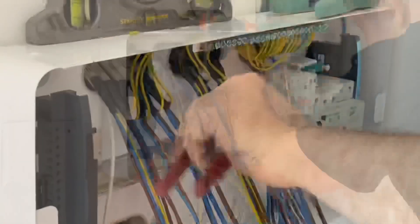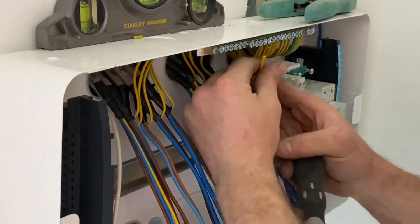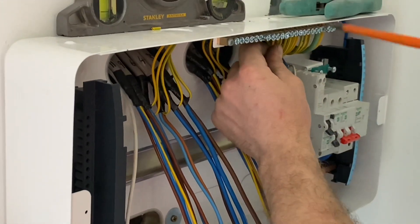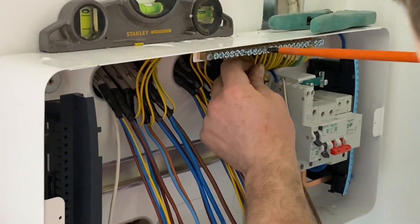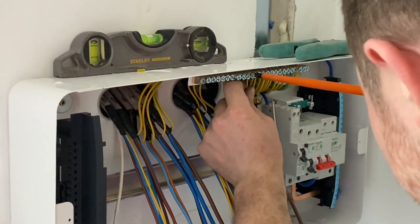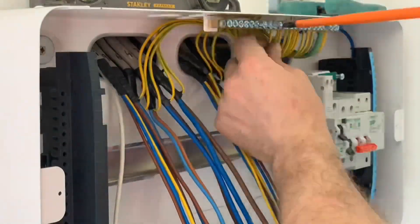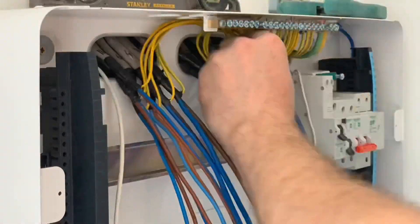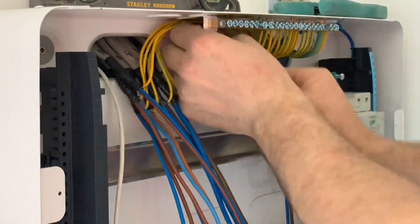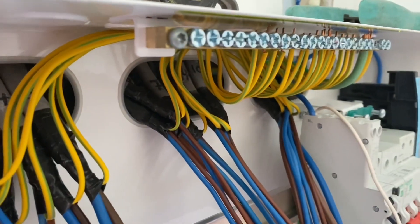There's also the alarm cable that was used to feed what is now a smart doorbell — at some point he'll over-sleeve that as well. Another problem we picked up on our initial inspection of this project. I always like to think when you take off the consumer unit cover and look at it, you make a lot of assumptions about the wiring within the installation itself. Ross took a lot of time to make sure that each of his conductors was dressed neatly into the board — all the CPCs going in, and then he'll systematically work his way to the next conductor.